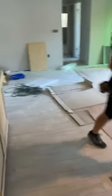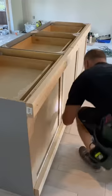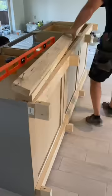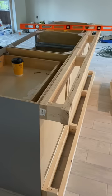Here are a few other options to make your island wider. If you want to add an additional 12 inches or more to the back side, I would suggest using wall cabinets that will give you that 12 inch depth — all you'd have to do is build a base so they'd be the same height as your base cabinets. Another option would be doing a whole second set of base cabinets, which would give you an additional 24 inches. For this island we only wanted an additional 6, so we framed it out with 2x4s.